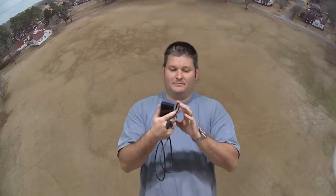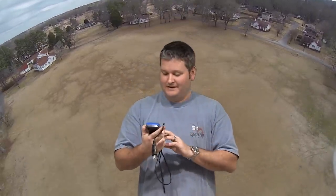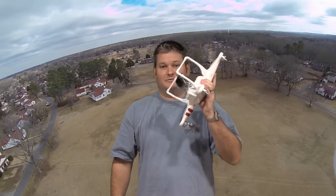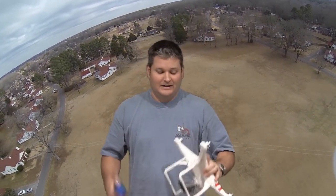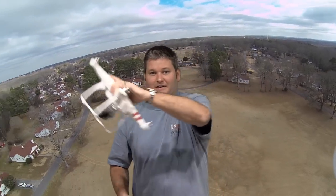It's just a really cool tool to have. These aren't expensive — you can get them on eBay. It's just called a demagnetizer. So just another tip for my DJI Phantom fans out there. You may have encountered the same problem and didn't realize it was the result of that magnetized screwdriver that magnetized your screws and resulted in wobbly flight because the compass could no longer function as it should.